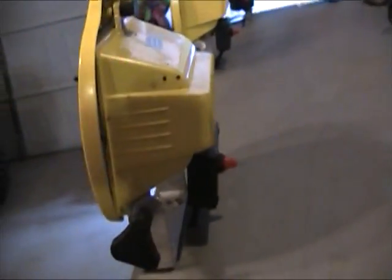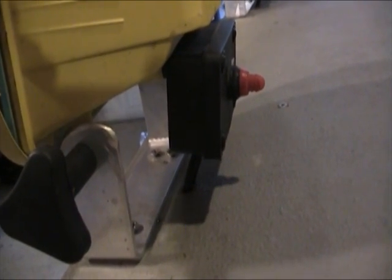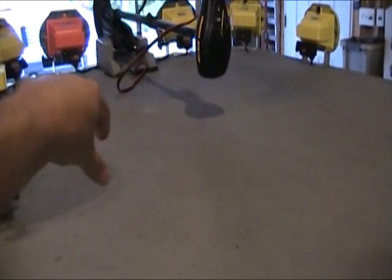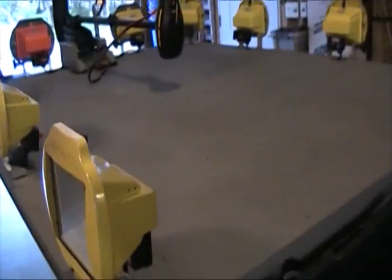For wiring, because this is a permanent setup, I drilled a hole through the deck, cut the head off the cord, pushed the cord through, and reconnected the head from underneath — a nice small, clean mount. In the middle of the deck on the underside, I have two power strips mounted. The cords from the lights plug right into those power strips, and those power strips connect to the main cord that plugs right into the generator. Nice, clean, very simple, and very affordable.